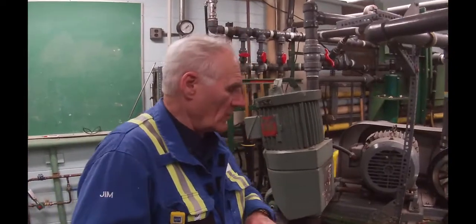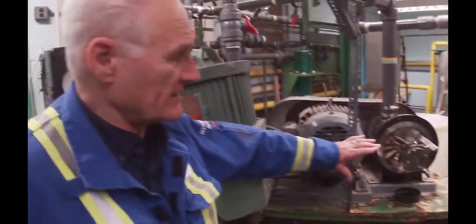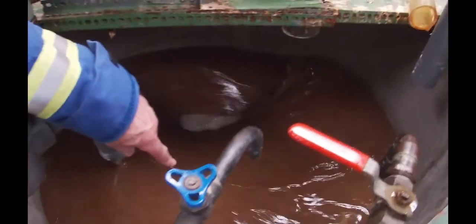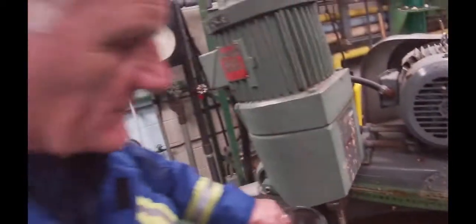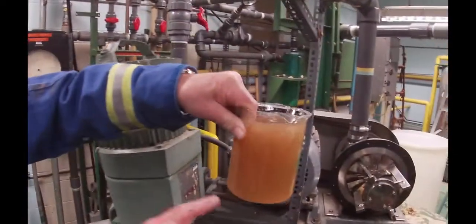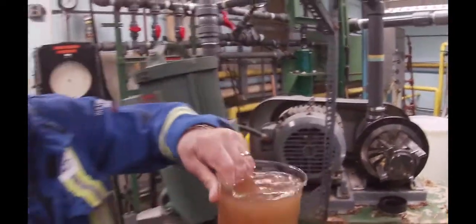So the stock was coming in. If you look at the back here, those vanes that are sitting in there are the distributor. So the pulp stock comes down, goes into that chamber behind, and then comes out on each one of these vanes. And then this is the actual blade that is spinning when the motor is driving. So we've got the centrifugal screen out right now and we'll leave it out. Down in the tank you can see the screen stock, and I'm going to take a sample of that because we have to run some tests on it.